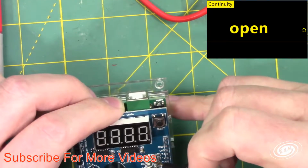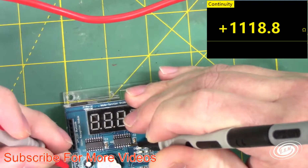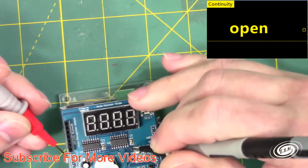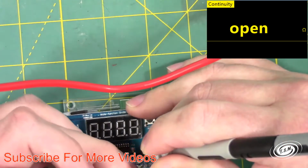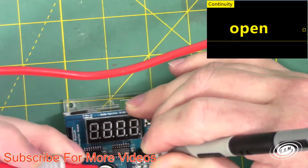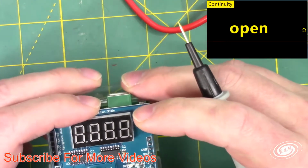So this could be a clear pin. Does it go to, is it high or low? Okay, it looks like it's pulled high with a 1K resistor. You can see that, it's ohms. So that looks like that signal's being pulled high. So like I said, this is pin 8. About this pin here. Ah, pin 4. Found it. So pin 4 and 8. Now which one is data and which one is clock, I'm not sure.